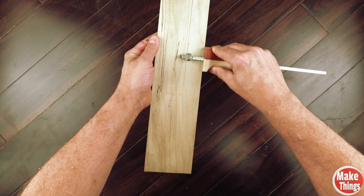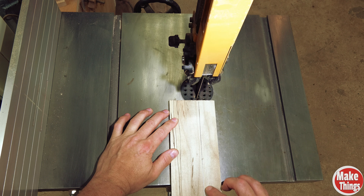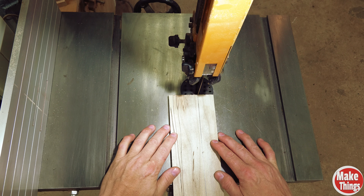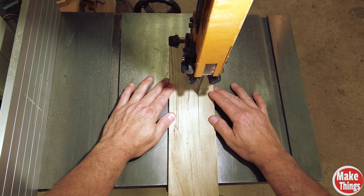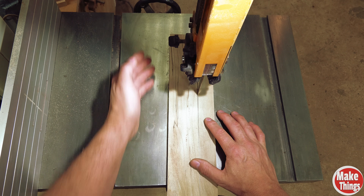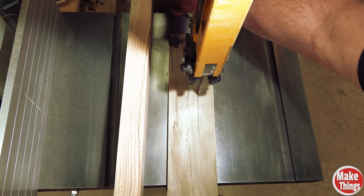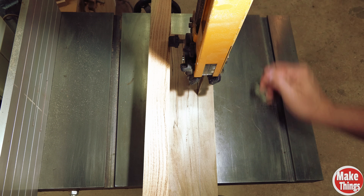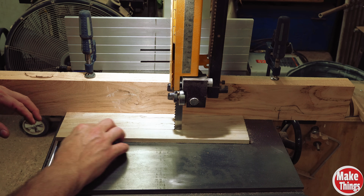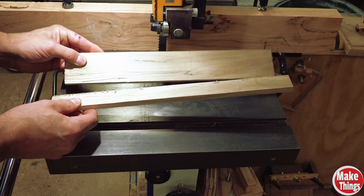The first method involves drawing a line that is parallel to the edge. Back at the saw, I'm going to follow the line that I drew earlier, get it about halfway in, and then stop the bandsaw. This, according to the experts, is the drift line. Now I can place an external fence on the edge, put it right on that line, and add a couple of clamps to the front and the back. Now as I cut, I should stay on that line. And that really does work very well.